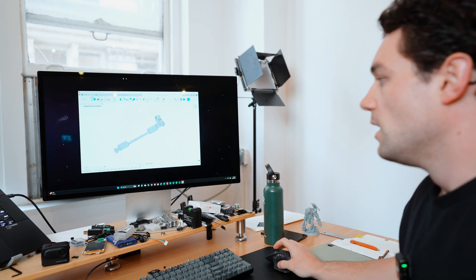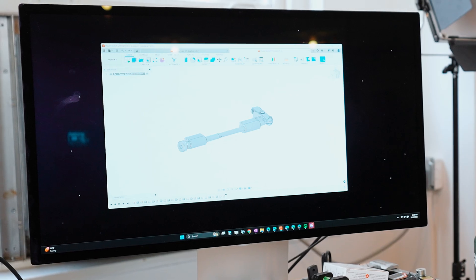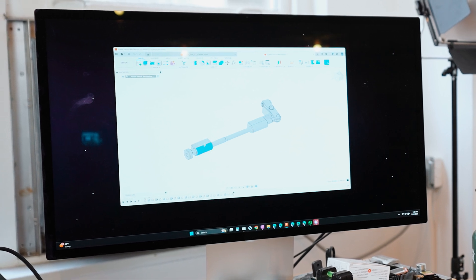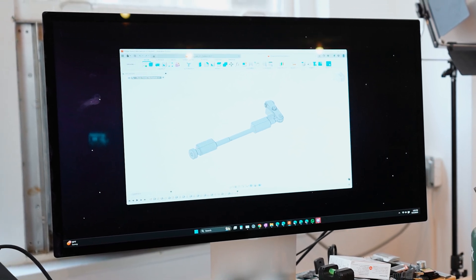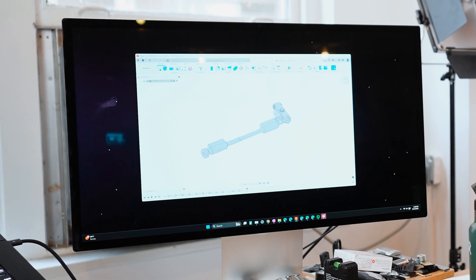This is probably not the final version, but now what we have is sort of a handle here that the robot can actually grab. I'm going to put a spring in this piece right here, and that will activate this lever to actually go and turn the switch on the printer off. Is it going to work? I think so. Is it the final version? Probably not, but it should be a good enough prototype to illustrate the concept, and then I can finish it up later. So let's print that now, get it attached to the printer, and then create the robot program to grab something out of the print bed, put it somewhere, and then turn off the printer.